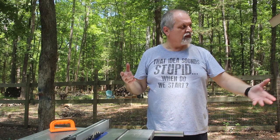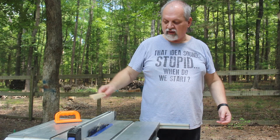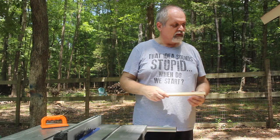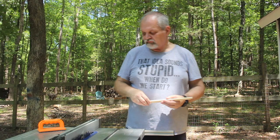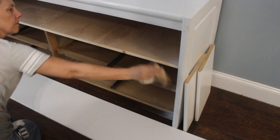There is a little bit of an assembly process here. We have a lot of repeatable cuts: four same cuts for the towers, and many cuts for the shelves. That's why designing so that you set it up and make all the cuts you need at one time makes sense. During this cut we were also careful to take any imperfections away from the wood — if we had any damage, this was the time to deal with it. So now we know we have at least three good sides because we made three cuts on each board. The next part will be to start staining.